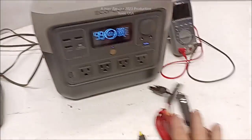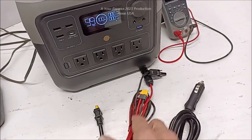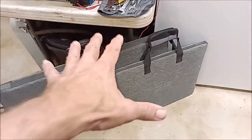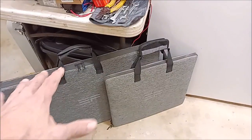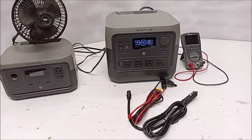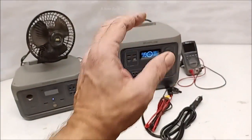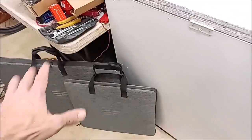It comes with your basic stuff — it comes with your automotive plug that'll charge it from the back, and solar input. You can get a choice between a 100-watt or a 200-watt solar fold-out set. EcoFlow has been picking really good quality solar panels. We did charge it originally from the big one and it got very hot — the wires got really hot — so we didn't want to charge it like that again. We charged the second time with the little one and it took a lot longer, but it charged nicely without getting hot. I can't recommend the big set of panels for this unit.